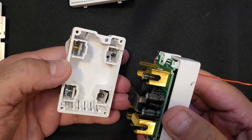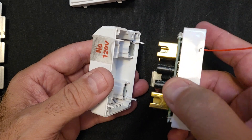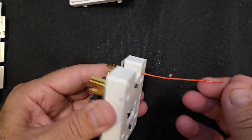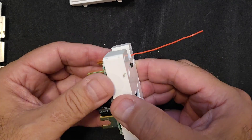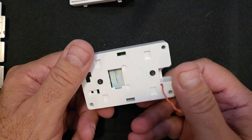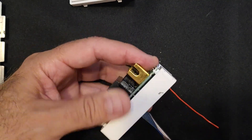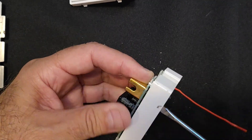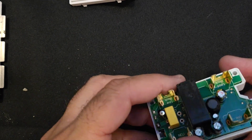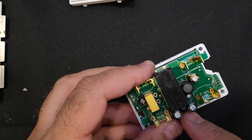Let's remember how to put this back together. The no-volts side here goes with these two capacitors. Now I'm getting this guy out. It looks like there are some tabs here holding the board in. I think I'm going to look at this underneath the magnifier first to make sure I'm not missing anything. Otherwise I'm going to go ahead and unsolder these six pins to take out this circuit board.